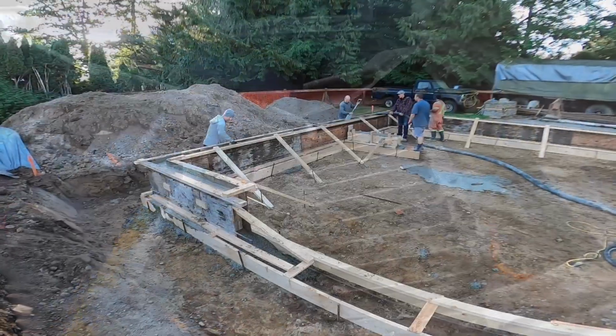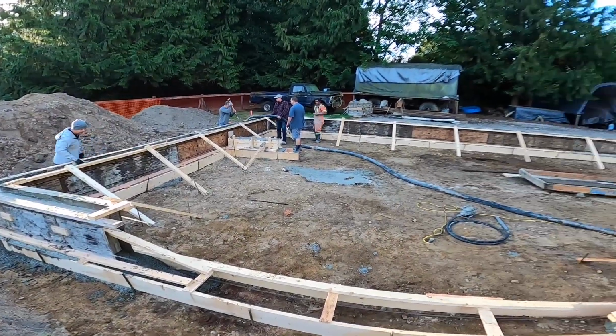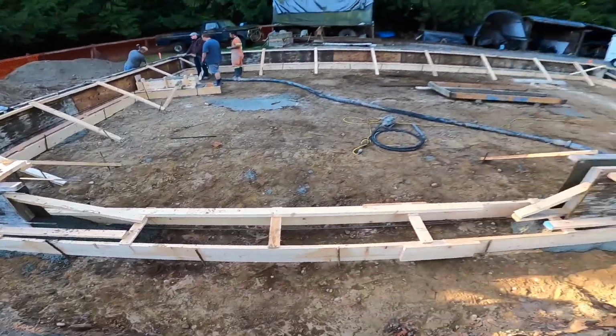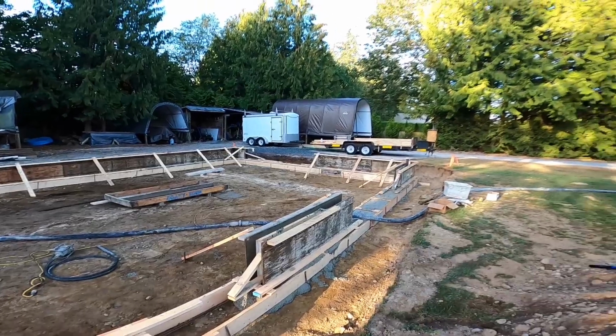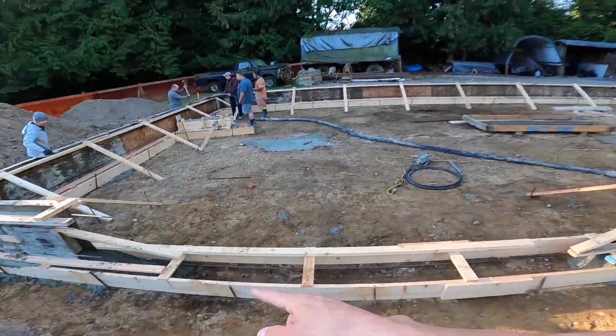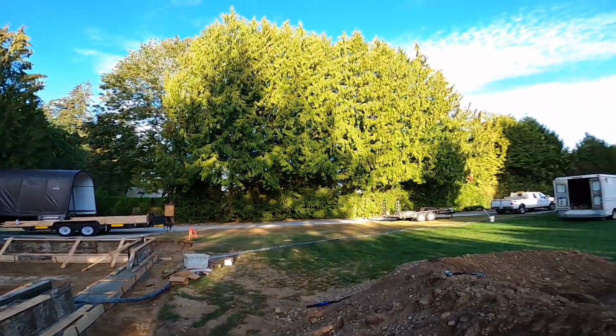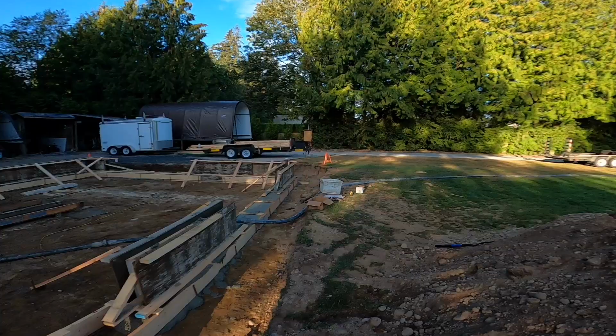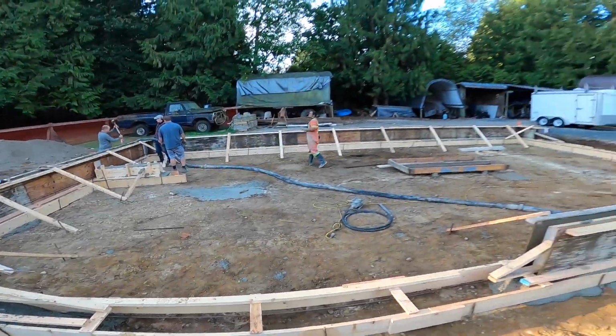All right, so we're just up on the top pass here. Left this one out to last. So what we'll do, once the walls are full, we'll go back and we'll slump the truck up. And it doesn't matter in this footing if it's a little bit wetter, and it'll make the blowdown a lot easier, as it will take less air pressure to push the concrete free from the lines. So that's what we're gonna do.